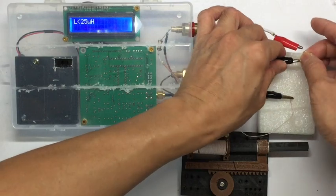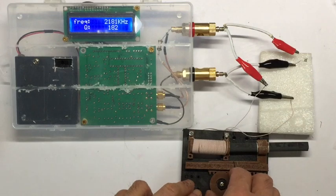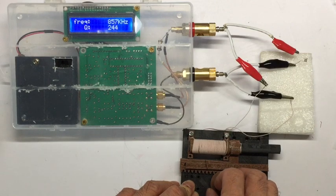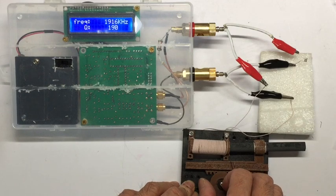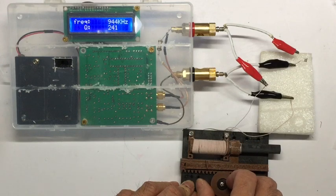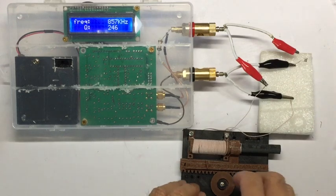Let's pair it up — connect the terminals from the Q-meter to both the capacitor and the coil so it forms an LC resonant circuit. You can see the Q-meter is able to show the frequency as you move the ferrite rod in and out. For this high band we are seeing a low Q of 186 when it's all pulled out and a high Q of 245 when it's all in.